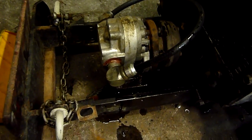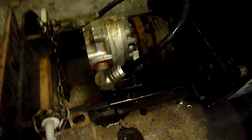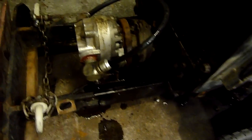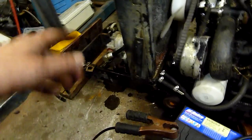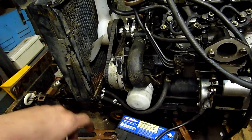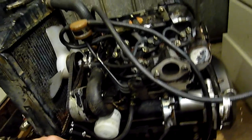Still a little bit concerned about the hydraulic pump, but I'm stuffing a fair bit of oil through it just to keep it happy. It's a gear-type pump, so as long as the gears and everything are lubricated, she should be pretty happy. That's my only real concern with running it without proper hydraulic systems hooked up to it. It's better than running it dry — if I didn't have anything hooked up, that pump would be trashed by now. It'd just run it dry and gone.